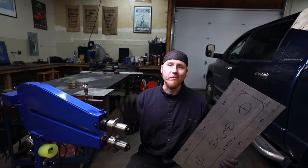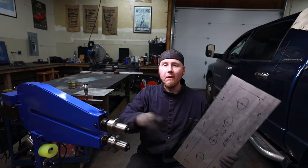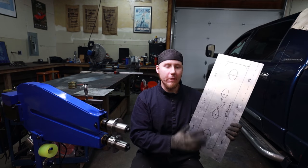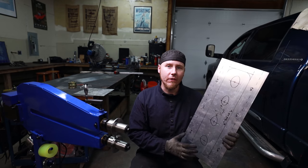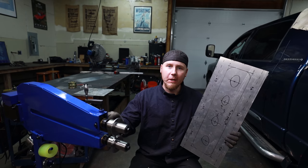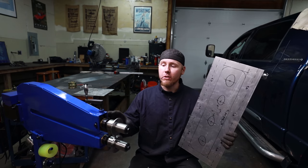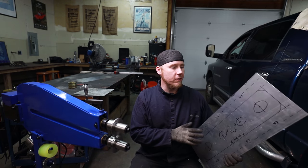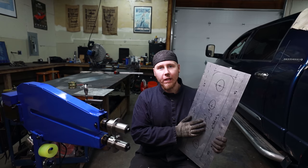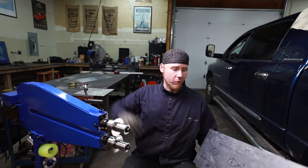I've got my studio lights set up and turned all the way up so I can clearly see the line in the die. I really don't want to mess this up — it takes a long time to do a full layout like this. I'm not worried about the dimple die holes or the metal brake. I'm worried about the bead roller because I'm just so inexperienced with it. So we're going to start with the bead roller, bead roll two of these panels — if it goes well I'll continue on; if not, I'm going to have to recut and retry the whole thing. Let's give this a shot.